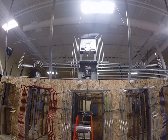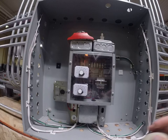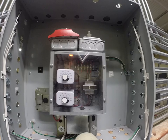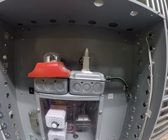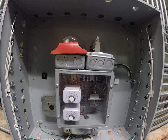What you see here is a control circuit. Looking at the control box, it contains nothing more than two off-delay timers, a control transformer, terminal strip, and fairly decent wiring. I made this about six years ago at a different campus, brought it here and rebuilt it so we can utilize it and have fun in the lab. On the top there's a fire alarm horn, there's a receptacle with a rope light plugged into it tied into the off-delay timer on the top, and there's another light up in the ceiling in the lab that's tied in.